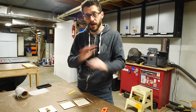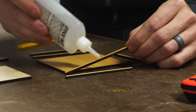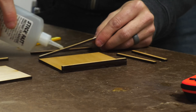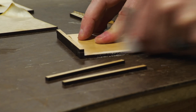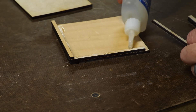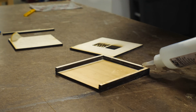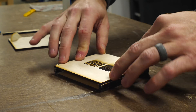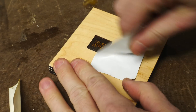These digital fabrication tools are awesome for incremental design and being able to make small changes very quickly. The plywood I used came covered in masking tape — that's really so you can easily remove the scorched effect around the engraving. I peeled that off and used some super glue to put these together. This wood was also pre-finished, so I did have to sand some of the areas where it was going to be glued to get a better hold. You could certainly use wood glue here as well — CA glue will hold on to the finish, but wood glue really needs to penetrate into the fibers. The masking tape peels off large areas very easily, but using something really sticky like gorilla tape helps pull off all the small areas to get the better detail.